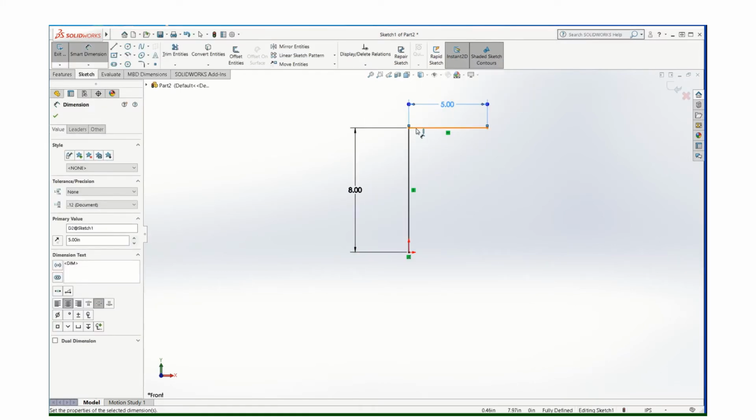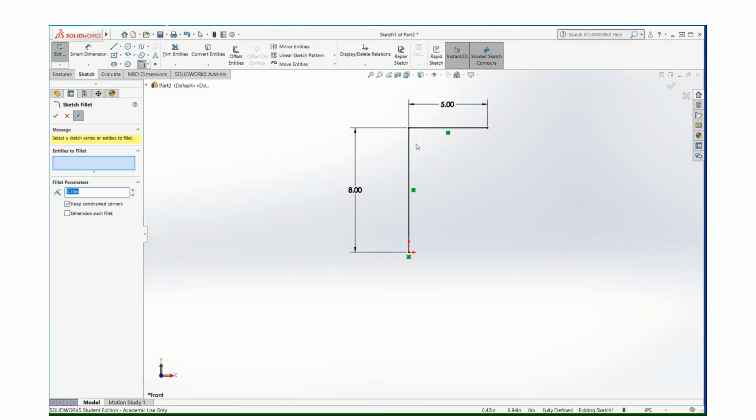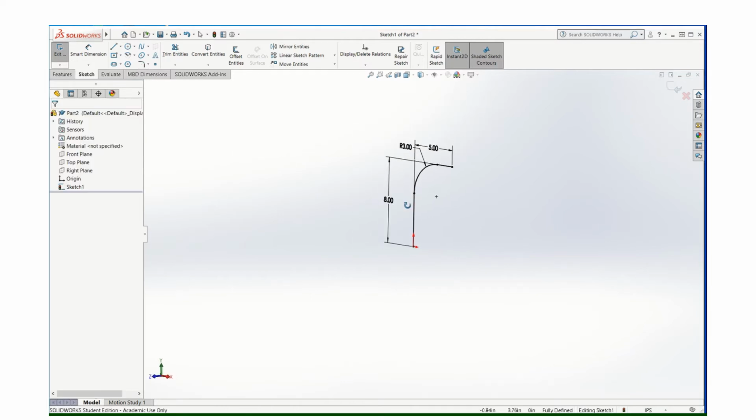You're not going to have a square corner like that. So go ahead and put the radius in there. Don't do that after the fact. So I want to radius this bend here. Now for tubing, you can't put it too tight because it'll just crush the tubing. About as tight as you can do is like a 3-inch radius. Okay, so that's going to be the path for my tube.